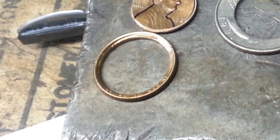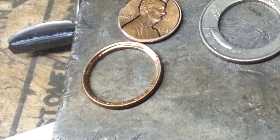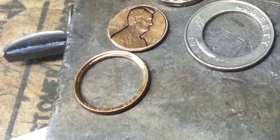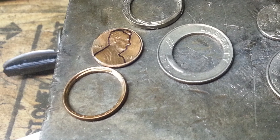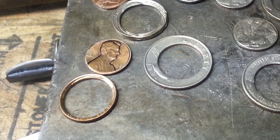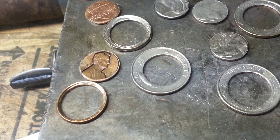The coins shown were punched to test functionality — it works pretty well. After these photos were taken, I also turned several different coin adapters out of PVC roundstock to keep the coins centered. The die will accept coins up to Eisenhower dollar size, about one and a half inches.